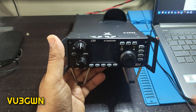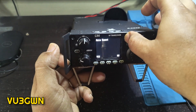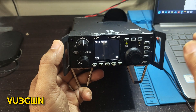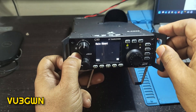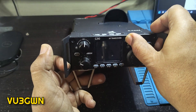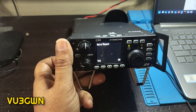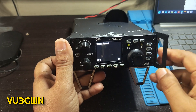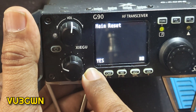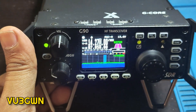To do a factory reset on the G90, hold the function button and then do a quick press and release of the power button — don't press and hold the power button as if you're switching it on, just push it and release, then let go of the function button. Switch it off, hold the function button, press and release the power button. It'll ask 'main reset' — click Yes. Please wait. The G90 has now been factory reset.